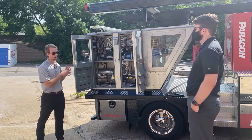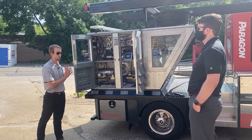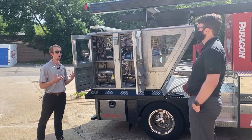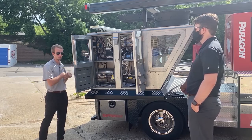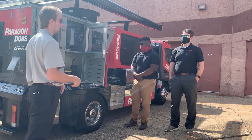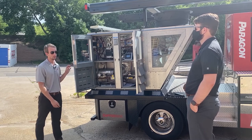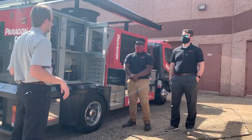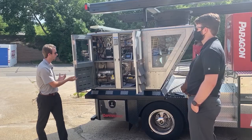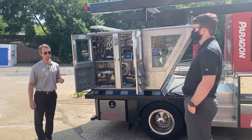We're going to be using a DOAS for our Paragon unit. Even in our size 1 cabinets, we're using these as rooftop replacements where outside air quality is at a premium. This unit can now replace a standard rooftop unit that recirculated 90% of the air it moves — we now have the option to provide 100% outside air with our size 1 cabinet. We'll go on a tour following the airflow from when it enters to where it exits.